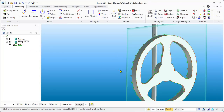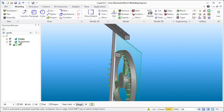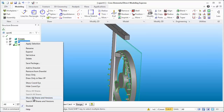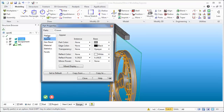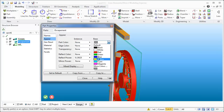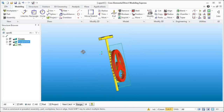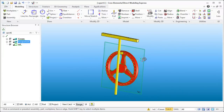The other thing I've been looking at is that it's kind of boring the way it is, so you might want to add a little bit of color. If we take the escapement, you can right-click on it and at the very bottom it says part properties. When you do that you can change the names, the appearance, and a whole bunch of stuff. Let's change some of this around so it looks a little better. Instead of escaping out and then going into the escapement, I can just double-click on it and go straight in to start changing the colors. That gives me a little more visual reference information by coloring the parts so I know what belongs to what and nothing blends together.